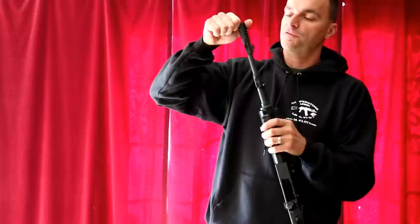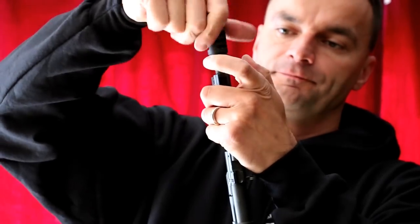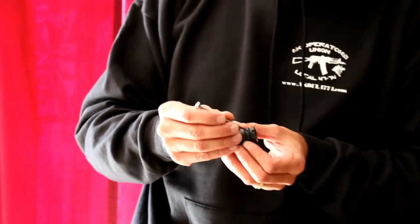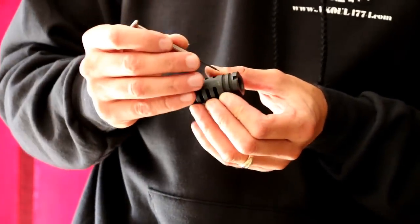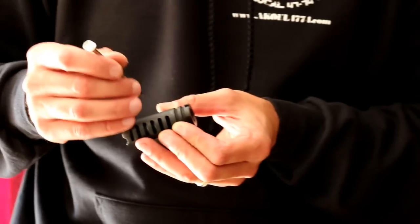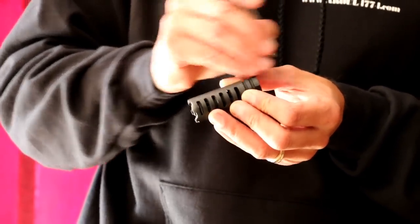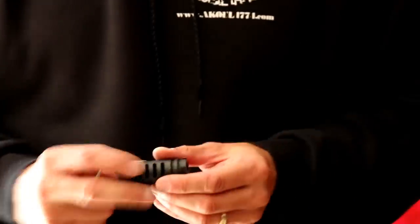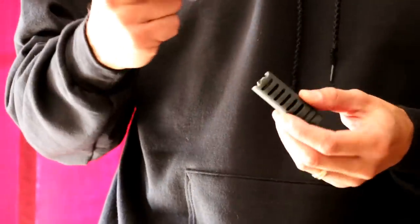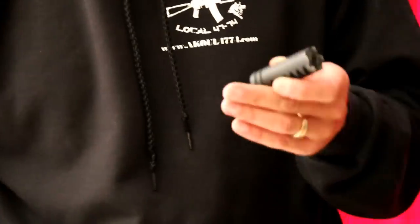Let me show you what we're going to do. First, disassemble the muzzle brake from the rifle. In some cases it's really a good idea to enlarge the hole which is designed for the spring-loaded pin on the front post — to make it deeper — because then it's easier to move your tool, push that pin down, and free the muzzle brake from the front post. The best way is to use the Dremel tool to enlarge that hole. In my case I think I'll be okay and don't need to do this.